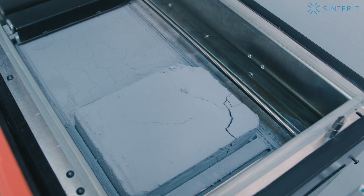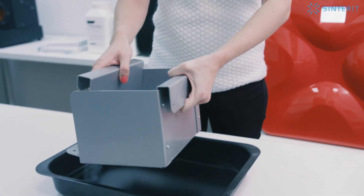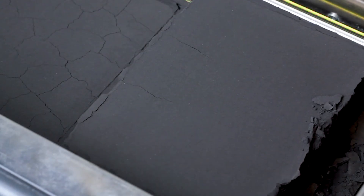Like the other powders in SLS technology, you don't have to use supports because the powder actually supports the parts itself. So if you want to print a huge batch of rubber feet for some product you make, or maybe a whole build volume of customized phone cases, this is a great material and technology for the job. SLS technology is really cool — you can print pretty much any geometry without worrying about support material, and layer adhesion or Z-axis strength isn't an issue with SLS, unlike extrusion-based printers.